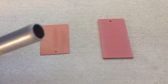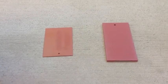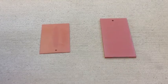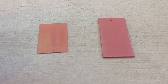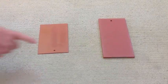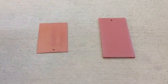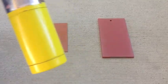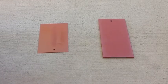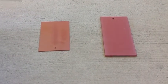What we're going to do right now is put our paint additive into a manufacturer's paint and check for flammability. We already know it's more chemical resistant and has better cleanability. The one on the left does not have the additive. The one on the right has the additive. We're going to use a propane torch and a thermal thermometer and see what we get as far as burn goes.